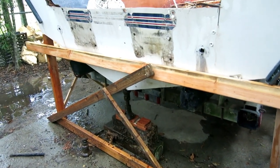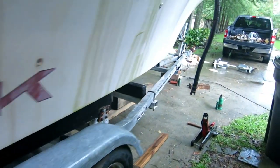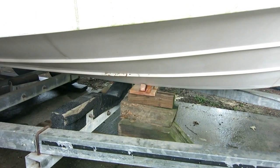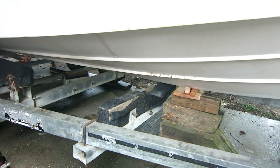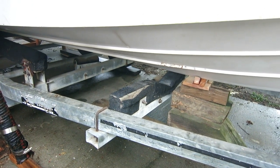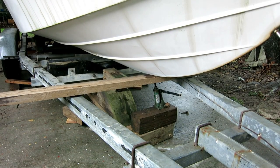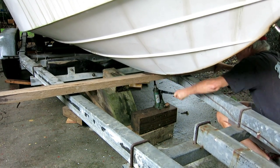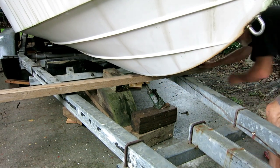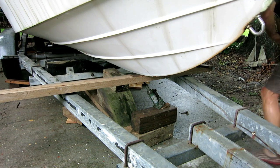I put one of my jacks under the middle of the back — I probably should have used a stack of wood for more stability — and added a vertical strut and cross bracing. The boat is heavy but it's just a hull right now, so not crazy heavy. I moved the trailer forward until I hit my stack of blocks. The process is: jack the boat up off the blocks, put another stack behind the trailer cross member, roll it forward a foot or two until the next cross member, and repeat. I developed a false sense of security and tried to go too fast — the boat fell off the blocks and landed on the trailer about eight inches crooked. A couple of tries with the jack at an angle and I got both front and back straightened out, then slowed down and was more careful for the rest.